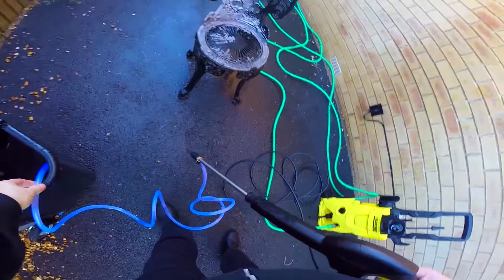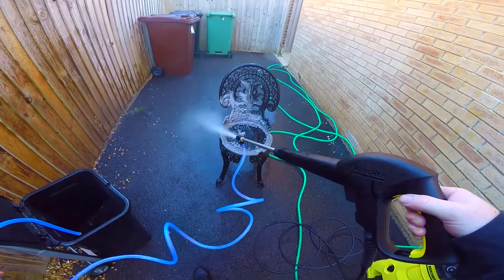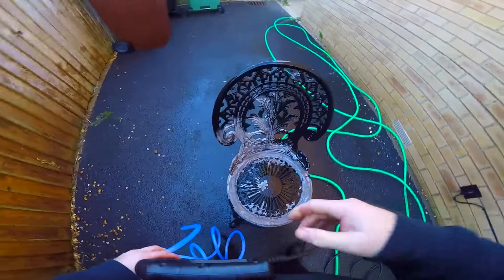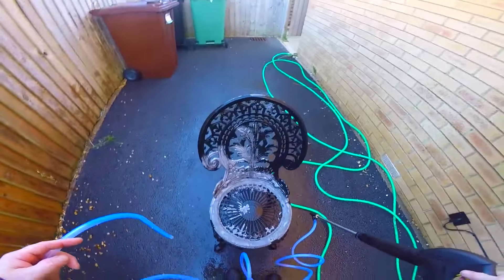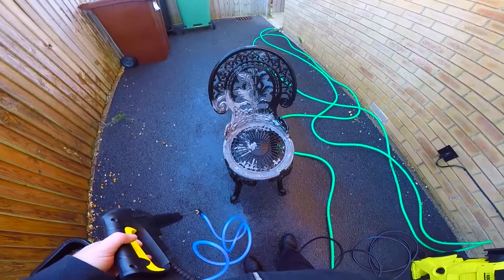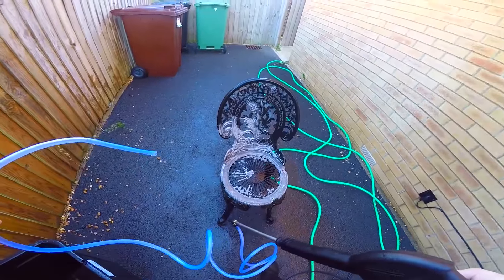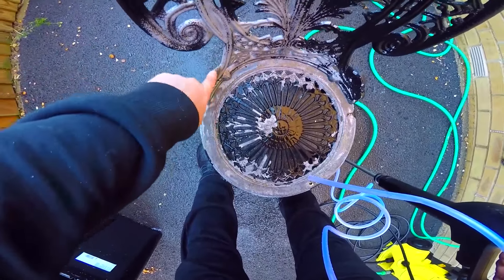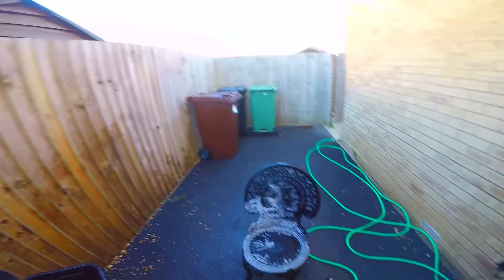I'll admit that's done a pretty good job. I think that looks pretty decent actually. Now I've got it working, there's a lot of grit on the floor. It leaves a lot of grit everywhere and it does hurt when it hits you, so wear some protection — it is pelting me in the face. Now I've got it working, I'm thoroughly impressed. It's done a decent job blasting that paint off. Then it would be a case of sanding and painting, or just painting straight on top.